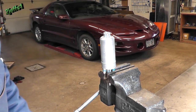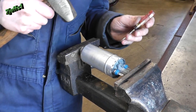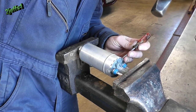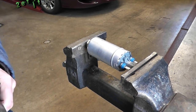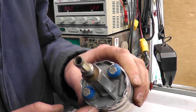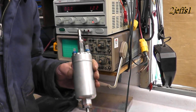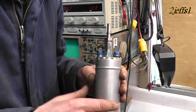That's it. I put some pressure on it with the vise to get a little more tension on the O-rings, and tapping in the little locks they had all the way around. Put this thing together — still looking pretty, but it should work. Got the barbs installed and I got the housing crimped all the way around to the end here. A little tip for you too: let your kids use the car, make sure you don't ever run it out of gas, because gas goes through these for lubrication. You crank, crank, crank, crank — that wrecks the crap out of these pumps, they really shorten the life. A little trivia for you today.